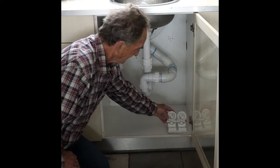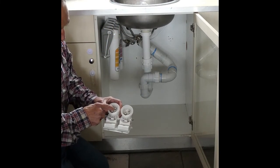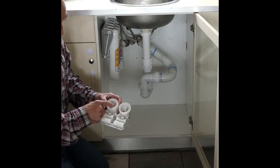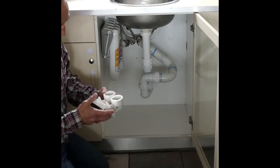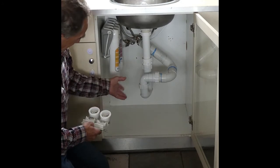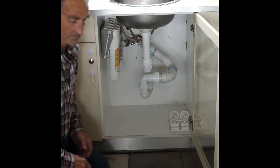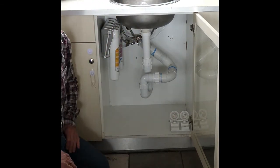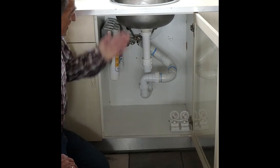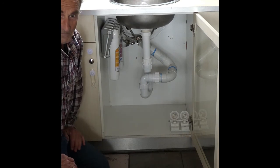If there are any leaks, it will be because of these rubber seals either becoming shredded or even bulging. You can find that when you undo the filters. But anyway, you just put your filters in, you check for leaks. If there's a leak, then you'll just have to change the seals. We run this for 5 minutes, check it again, and that's it. Nice and easy.